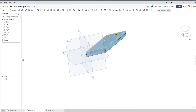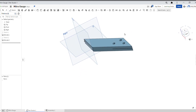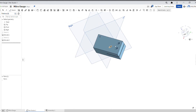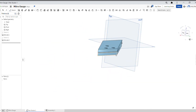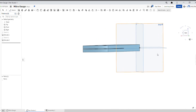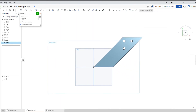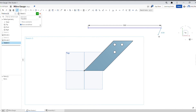We're ready to move on to the blade. Ordinarily I might create a totally separate part and use an assembly to put the two together, but with top-down modeling we can create the part in this space using the features we've already created, so we don't have to put in as many sizes. The blade needs to fit in this gap, so the best place to draw it would be on that plane that passes right through — that's why we created it either side of the centered plane earlier. I draw a sketch on this plane, go to the top view, and draw the shape: it's 300 long with something coming back.